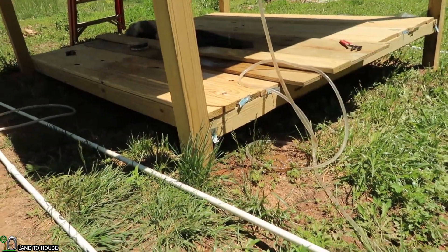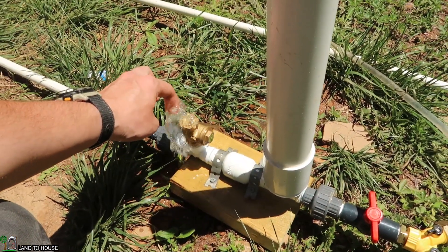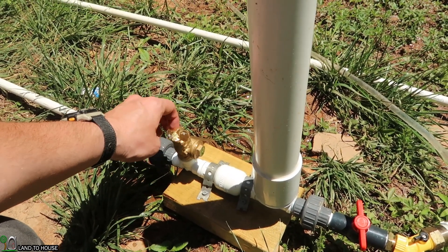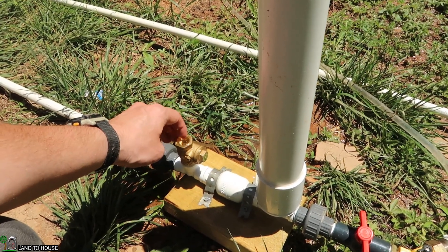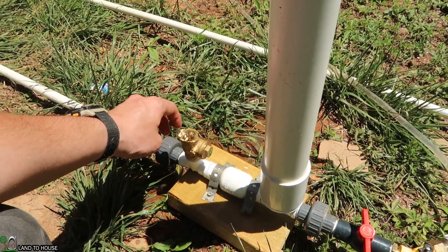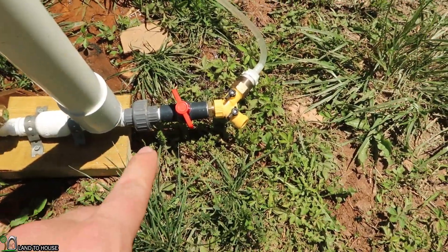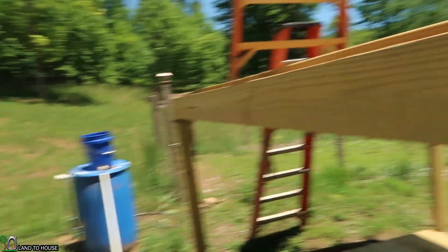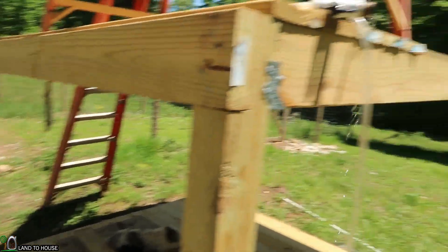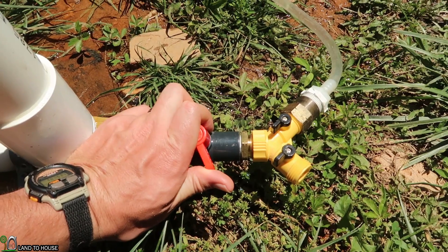Enough water is still coming out to cause an issue. It's close, but I think we got it. The valve is almost totally shut and we're now pumping water to five feet with three feet of head pressure — very, very close tolerance there. As we've noted, if this valve is just ever so slightly adjusted, there won't be enough friction loss there.